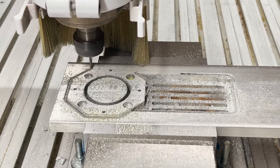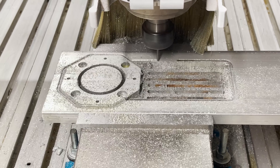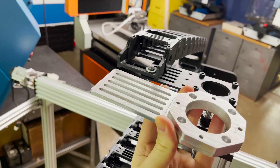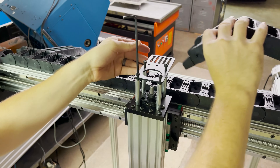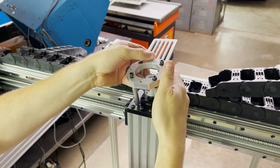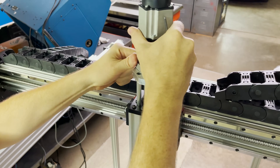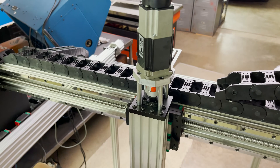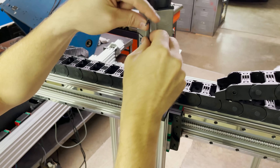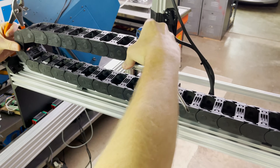If I had to do it again, now that I have a laser, I would just make the drag chain mount a separate piece out of some thin plate. Here's the finished part after cleaning it up and tapping a few holes. Now I can remove the original Z motor mount and drag chain and install the new one. I had to buy a different brand of servo motor for the Z axis because of the specific requirements of the controller, and I got one with a brake so that the laser head doesn't fall when it's not under power. Now I can go ahead and reattach the drag chain.